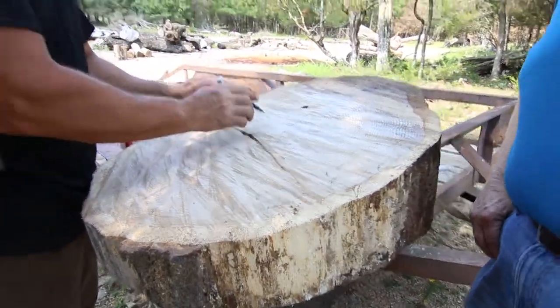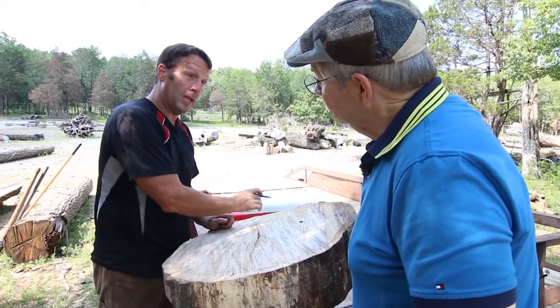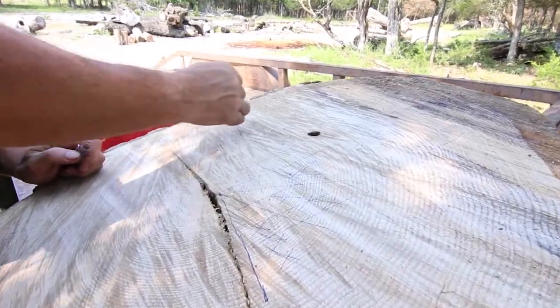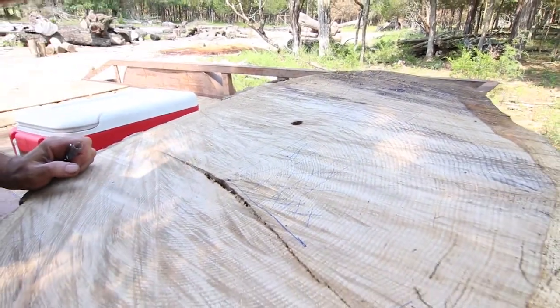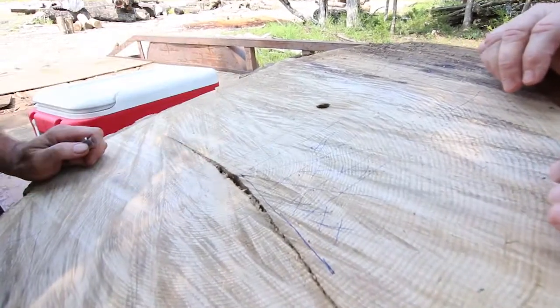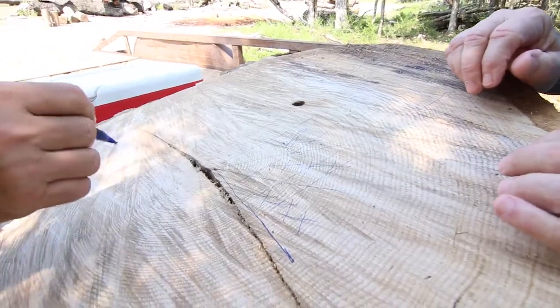What's interesting is each different type of cut will produce a board with different grain patterns as well as different structural characteristics. Your flat sawn, because of the way the grain runs parallel to the face of the board, will give the face of the board more of what they call a cathedral grain, to where you'll see the towers, so to speak, as you go through it. And as we do our cuts, you'll be able to see that. Yeah. As we get into the rift sawn cuts, you'll see grains that are actually very straight and very true and very linear with the face of the board. And then, of course, the quarter sawn boards are where you actually get the show, if you will. You get the medullary rays that begin to pop through and really show that lace wood effect.